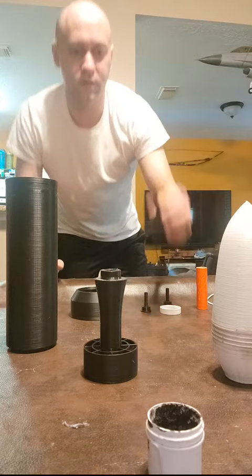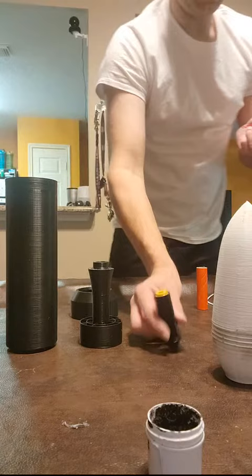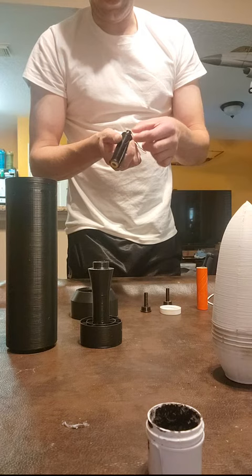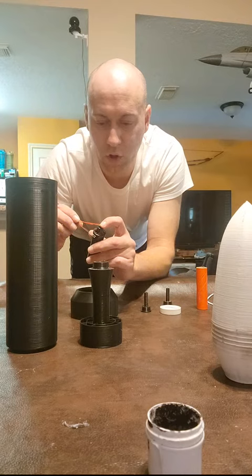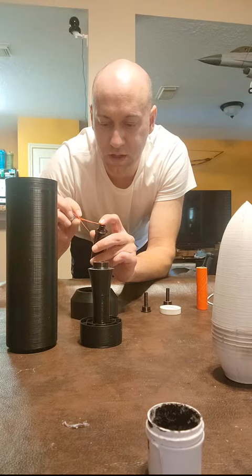All right, so we have our motor here. We have our tail fin segment here, and it looks like our pyrogen is already starting to crust over. So next we're going to take our igniter and insert it all the way up into the motor, fully into the bulkhead of the engine. That means we're going to insert the motor igniter until it stops. Off camera, what I've done previously is I have taken a paper clip and scratched up the fuel grain on the motor, and that causes the fuel grain to get a nice rough surface on the inside. It causes a more rapid ignition and case pressure to build up more quickly for launch.